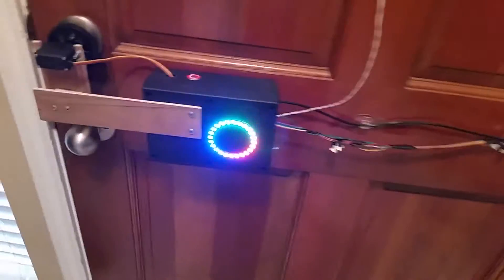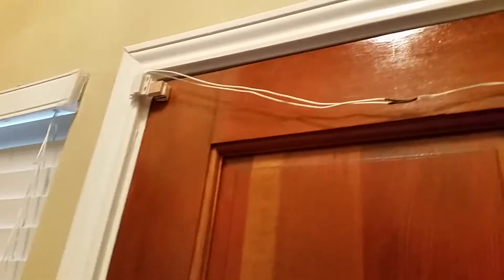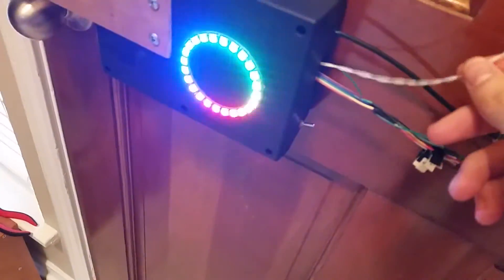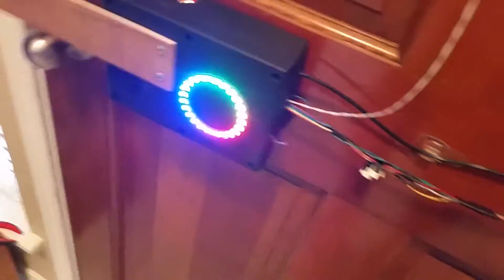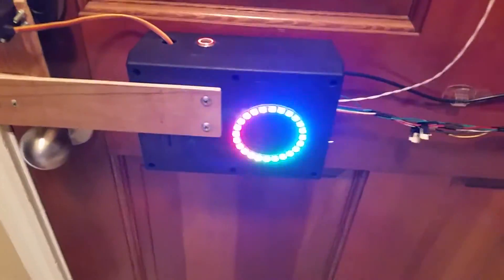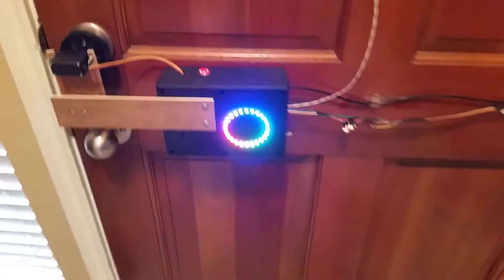This was a really simple addition. Just get this door sensor — it's got two wires. I hooked one of them up to ground and hooked the other one up to pin 3. This is an UNO; you have to hook one of them up to pin 2 or pin 3 to use the interrupt service. That's all I did.